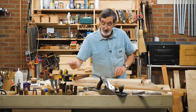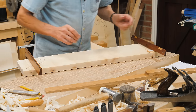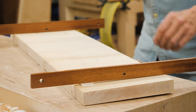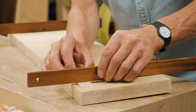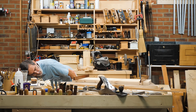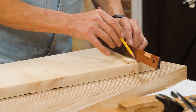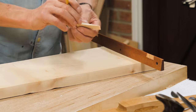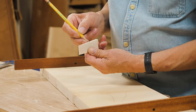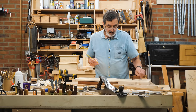What I can't tell is exactly how much it's twisted. So what I'm going to suggest to you is make a wedge, put it under one of the winding sticks, and keep moving that wedge further under or less under until you feel like you're at a board that's not twisting. So these are both level now. I just take a pencil, I mark it, and then I take this distance — it's how much it's twisted. If I eyeball the centre of that distance, I can use my finger as a gauge.